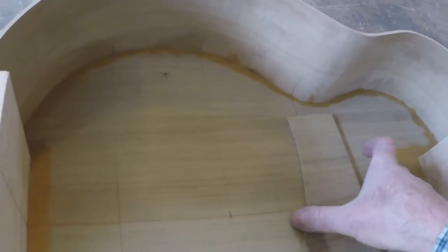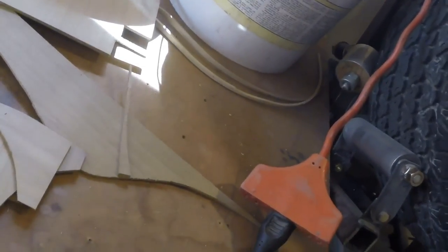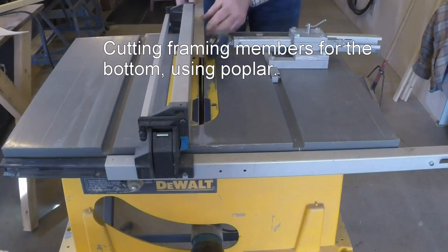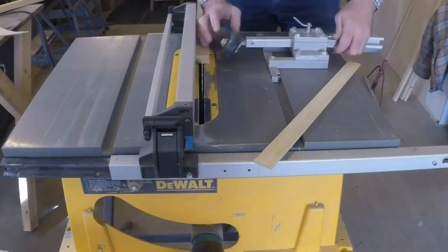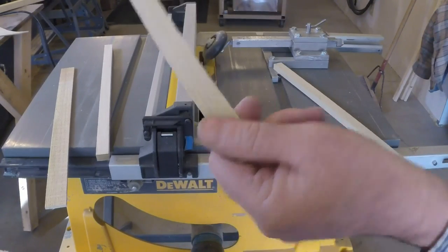Rather than a piece of maple with parallel grain — they do call for maple — I can take a piece of eighth-inch maple and snap it pretty easily by hand. So they're saying that's going to strengthen the joint, and they're right, but it's not going to strengthen it much at all. The glue would probably be the strongest thing. However, if you put a piece in with cross grain, you have some serious strength. So that's what I'm going to do — I cut two of these pieces. I like pieces like this; they're great for glue sticks or shims.